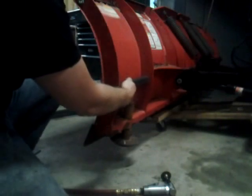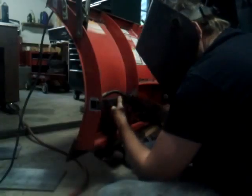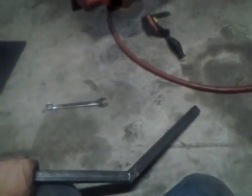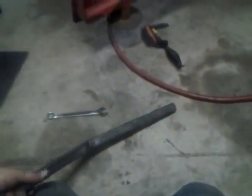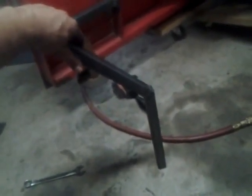What will happen here now is that will go in there flush with the outside of this rim. We'll weld it to the inside there, which is going to be quite a bit of support. This is the first one for the bottom wing — no measurements so far, it's just going by eye. I kind of want an aggressive angle because I like to keep as much snow in the blade as I can. That's probably close to a 45, and that's what I want, so that's what I'm doing.